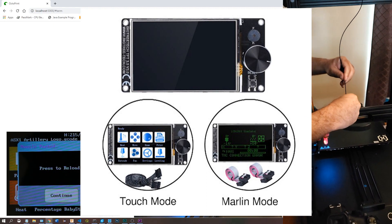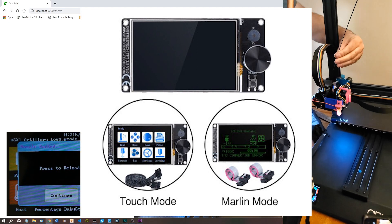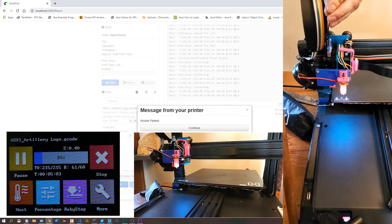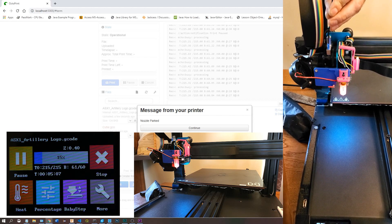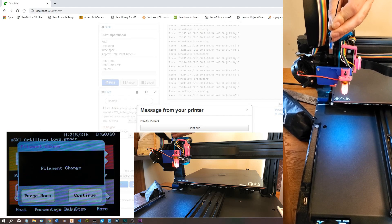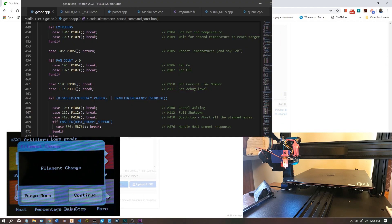The wiring between the two modes is very different, as is the mode of communication between Marlin and the LCD or TFT. To sum it up, Marlin mode is a different type of hardware interface with different capabilities. Because this is an unconventional use of the hardware, the firmware in the TFT obviously was not ready to handle this either. The TFT I'm working with is an MKS TFT-28 clone used by Artillery in the Genius and Sidewinder. I have modified a branch of the BigTreeTech compatible firmware adapted by BlueForcer. I've had to modify Marlin on the back end with about five lines of code.